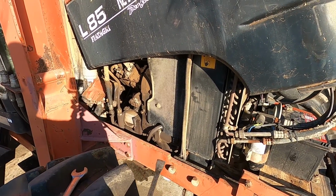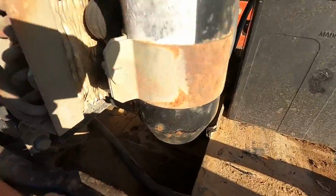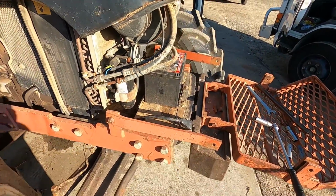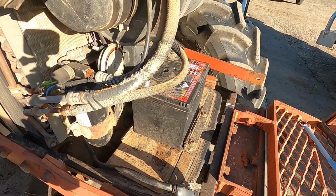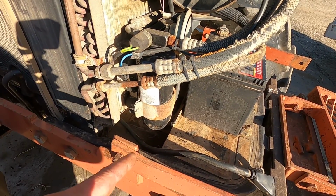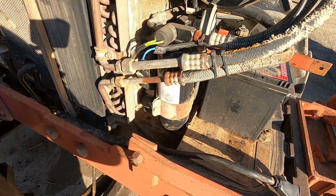What I normally do is check the grounds. Now the ground on the starter motor is actually grounded by the engine, and the ground for the battery, I don't know if you can see, it's right in there. The starter motor hasn't got a direct ground to the battery, so I'm going to make a direct ground wire from the battery negative to the starter motor straight, to give it all the current, because at the moment the current's going through the engine block, through the chassis to the starter motor. So it's just a quick fix. If it works, it's an easy fix and a cheap fix.